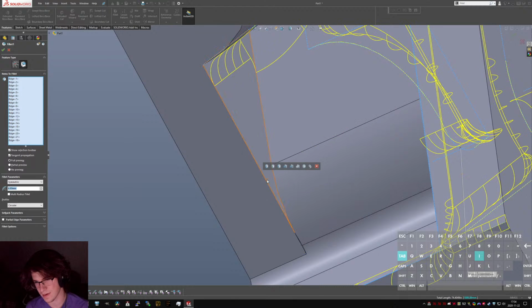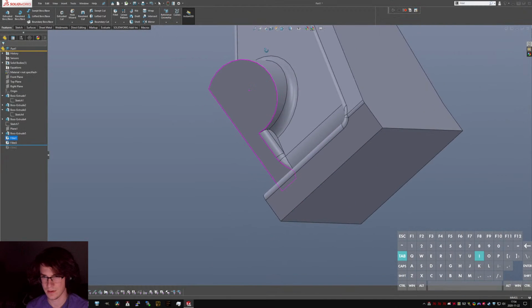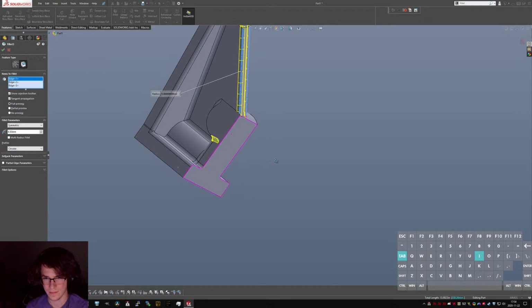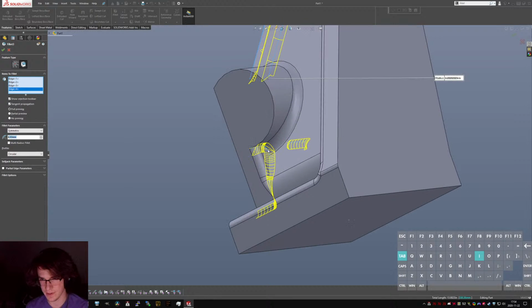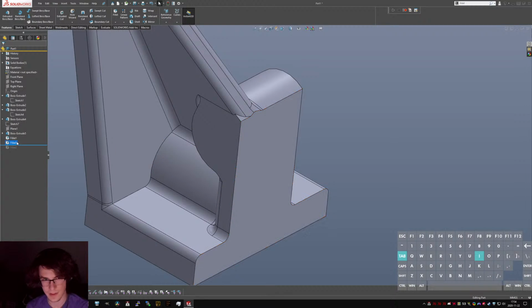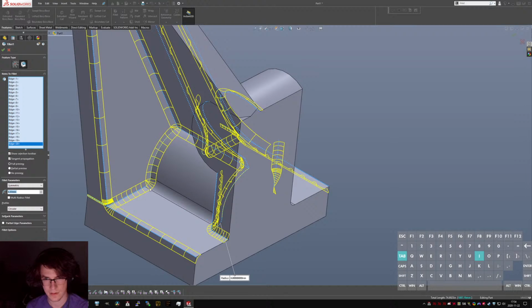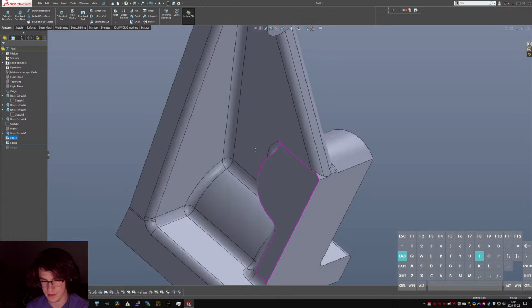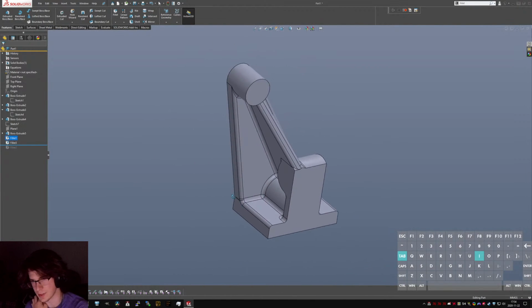Oh, God. This is so bad. I'll save that one for after then. I'll do that in this second pass. It looks like I missed a different fillet down there too. Yeah. This one could definitely come into the first pass. And that kind of gets all of the really obvious casting edges. The ones that you'd want to do if you were doing this with sand mold, I think, and then machining the outer faces.